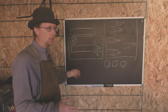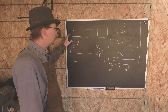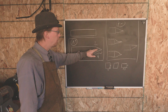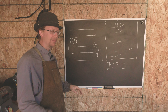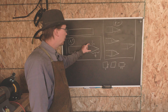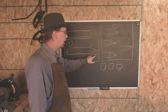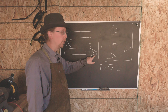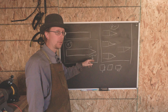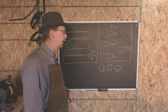We're going to start out with 24 inches of 3/8 inch square stock, and we're going to put a taper on it. The lesson didn't give an exact amount. For my purposes, I'm going to mark off two inches at the end of the steel, and I'm going to draw that out until it's four inches long. I chose the four inch measurement because that's how long my anvil is, so it makes a nice guide as I'm drawing it out.